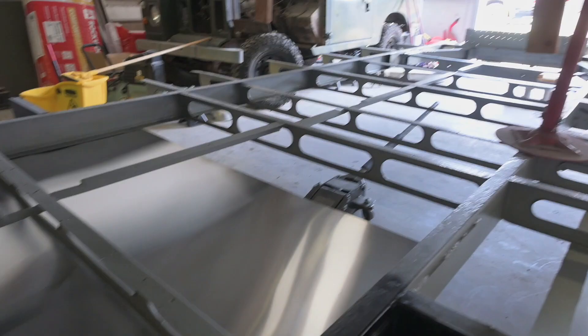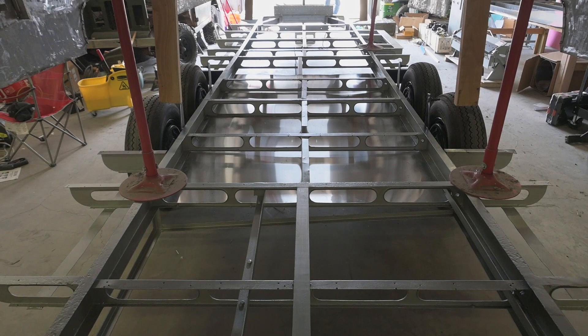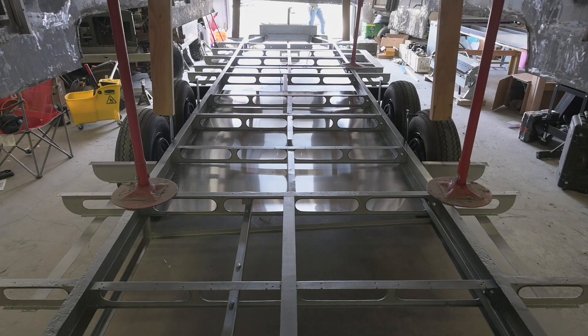As you can see, I got some of the belly pan already on. I'm basically starting the belly pan a few cross members up, right where the tanks are gonna be. I have a support down there that is going to have another pan on the bottom of it once the tanks are all in and the plumbing is all done. I should be able to get all the plumbing knocked out before the subfloor is in, but I still need the senders for the tank level monitoring. Those can go on and then I can put the belly pan on in that section.